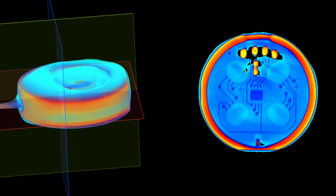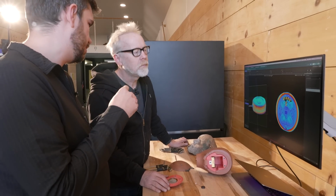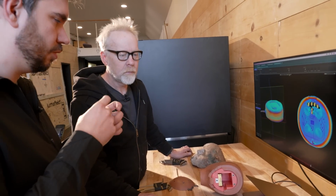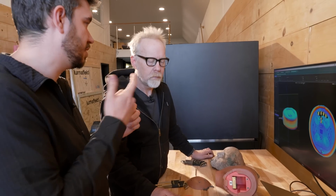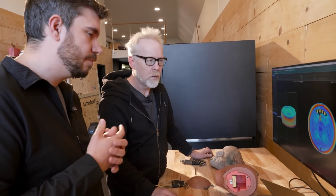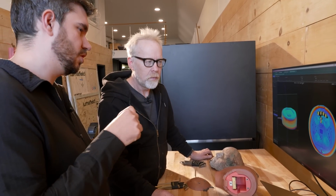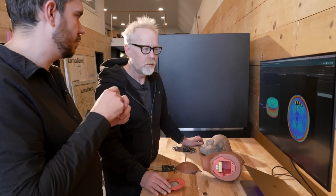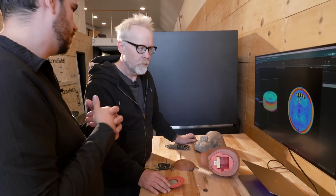And the way that I'm guessing this works is that it's a Wheatstone bridge, which is a system where you have 4 resistors, and 3 of those are set resistance values, and then the 4th one is a variable resistor. And as that resistance changes, it'll change with different forces or different temperatures or different deflections. And so you actually just measure the change in voltage across this circuit. Depending on the change in resistance, the amount of force that's being experienced.